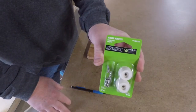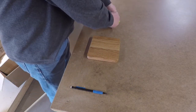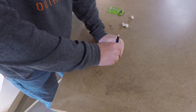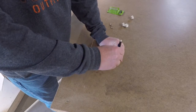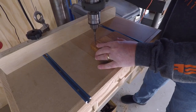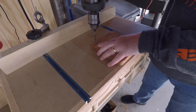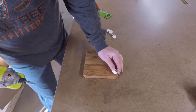Back to the base — I purchased some rubber feet from my local hardware store. I'll pull one of the feet out of the package, place it on the base to mark the location, and pre-drill some holes for the mounting screws. With a brad point bit in my drill press, slightly smaller than the screws themselves, I'll drill a pilot hole in all four corners, then screw the feet to the bottom of the base.